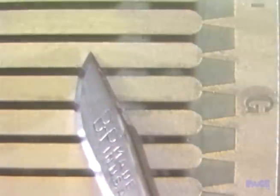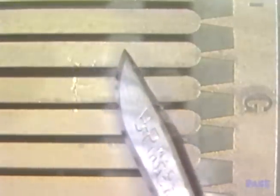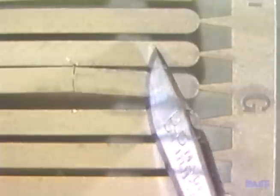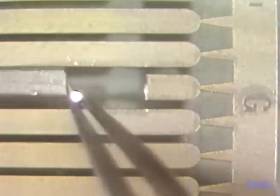On this end, we'll use a bevel cut. For this other end, it doesn't matter — we'll purposely cut it too long because we have to fit it exactly. Place it overcut to undercut in the excavated area to measure for correct length. It's just a little bit too long, so we'll trim it right here. Be sure and take it off the board to do it, though. This end will get an undercut, since it has to match with the overcut on the conductor end.